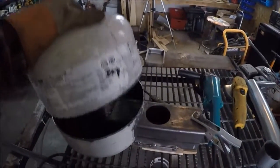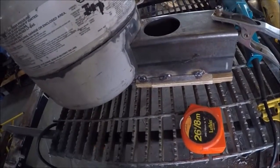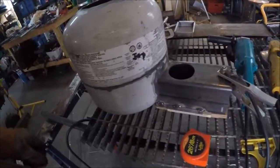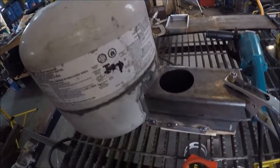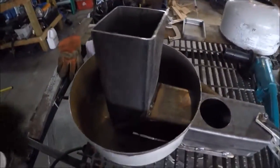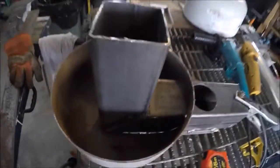I've just tacked in the burner. So there's the burner — you can see that there's a gap underneath the bottom for insulation, and the top like so. That looks pretty good, almost dead center. Maybe not perfect, but really close. So before I go further, I'm going to install that before I can't weld around it. I'll weld this side first on the burner, tack the bottom of the burner first, then I'll tack that back on, test fit it again. The next step will be building a shroud to go around this so that we can stuff it full of vermiculite, and sealing in the bottom as well.